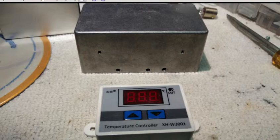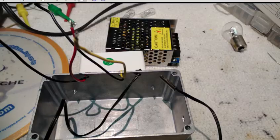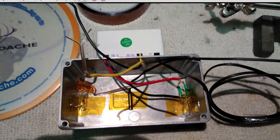There is the temperature control unit I bought off eBay for about five dollars, and the little aluminum box that I mounted it in — I've drilled the holes already for the wiring and the mount. There it is with the unit mounted on the box and the wires through the holes. You can see the 2 amp 12 volt power supply, just a tiny little module that just fits in the box, and up at the top the two little marker lamps from automotive that I use for the heat source, 4.9 watt lamps.